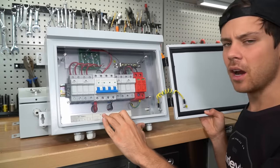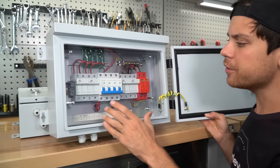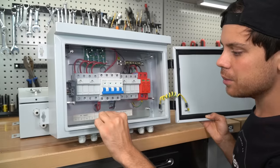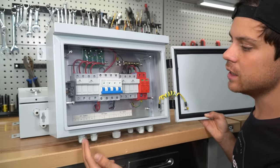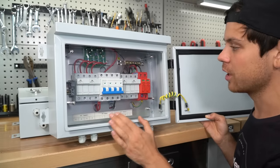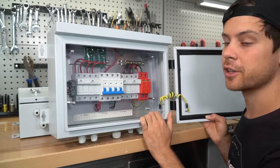That's pretty much it — a pretty simple device but very confusing at first. I know if you're building your first solar system and you see all these wires you're like, 'what is going on?' But just look at the labels and follow the instructions. DC positive over here, DC negative over here, connect the output to your charge controller. Also ground it if applicable for your application.